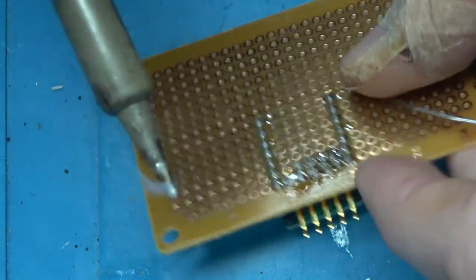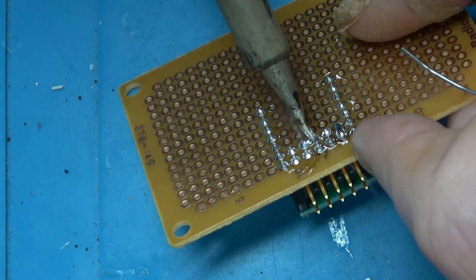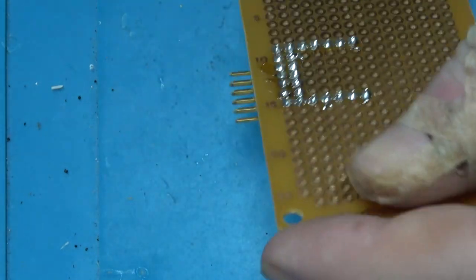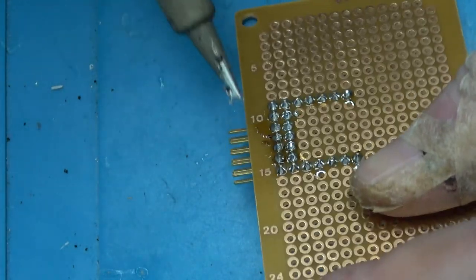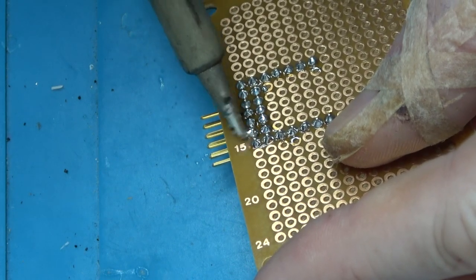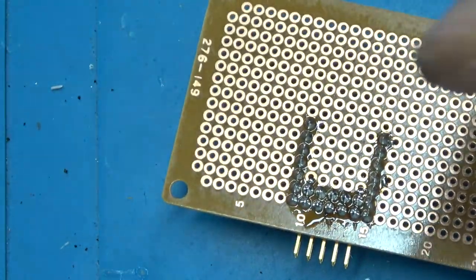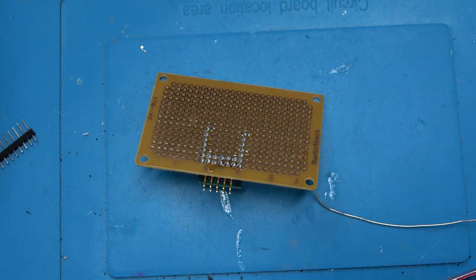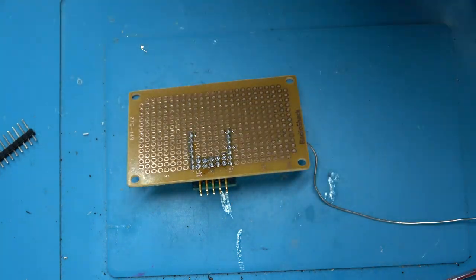Now, as some of you probably know, the Nintendo controller had one 8-bit shift register in it. It was hooked up to the buttons in parallel. And when the Nintendo, or specifically the programmer, wanted the data, the programmer actually had to shift the bits via software. So the programmer would send one pulse to latch the bits, i.e. load them off the buttons into the register, and then pulse it eight times to clock the data back to the NES.